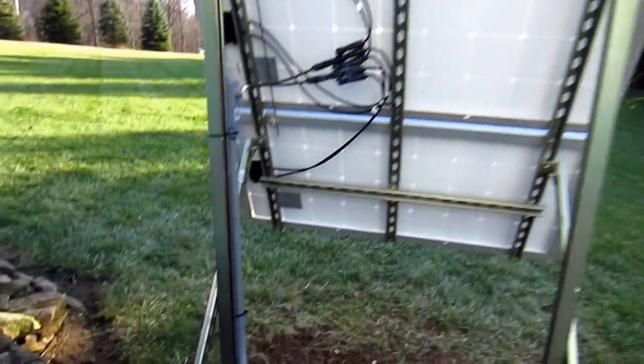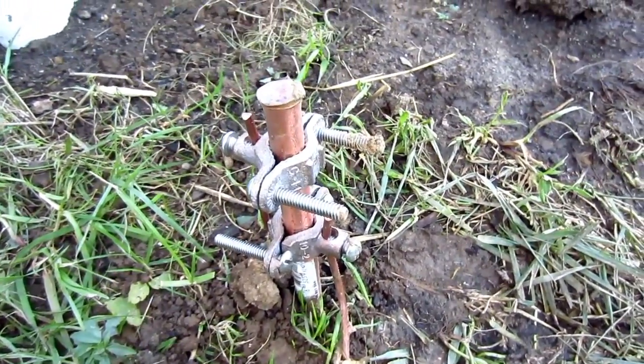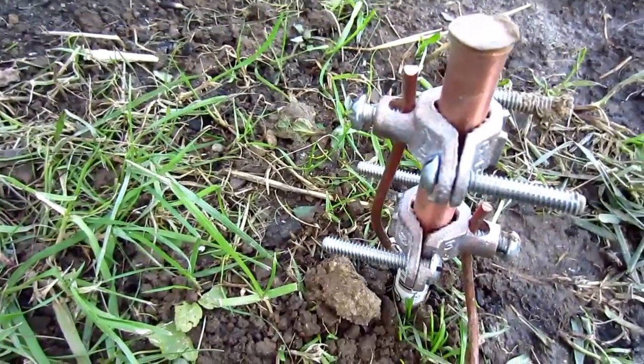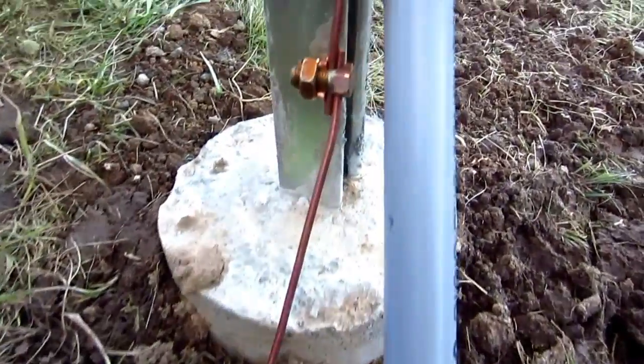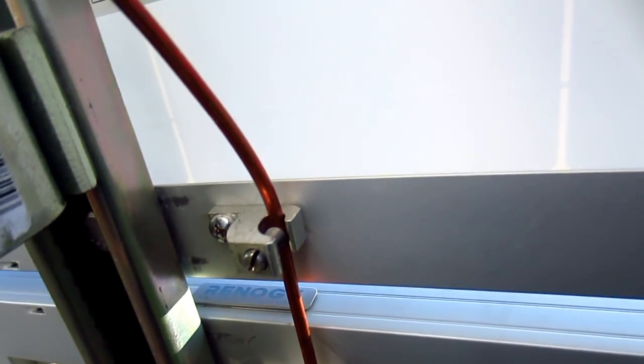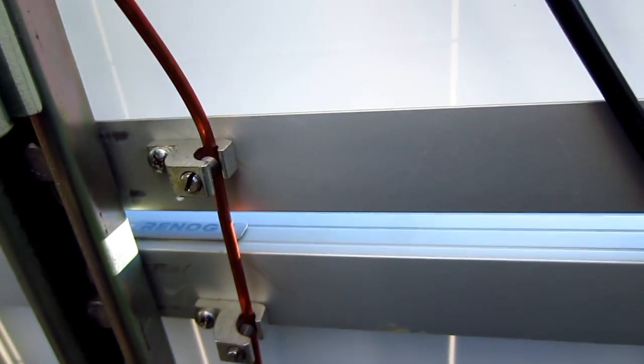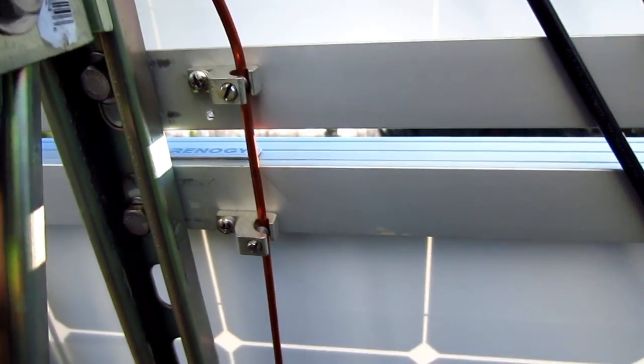Let me go over lightning protection. I protected both the solar panel structure and the inside electronics by running 6-gauge electrical conductor to this 8-foot grounding electrode. You can see the bonding clamps holding those conductors in place — one goes to the solar frame, one up top, and then one bonding clamp for each solar panel, making three total. These bonding clamps are tin-plated copper; they're Ilsco model GBL-4DBT — I would recommend those. Don't use copper directly against the aluminum.